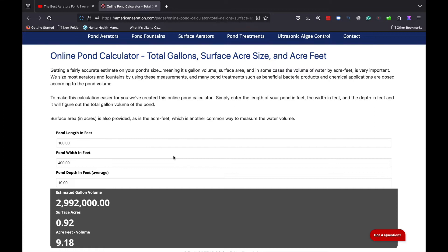Now if we're trying to cover a pond of this size, we will not likely do it with a single diffuser. No matter where we put it along the length, we're not going to be able to affect the entire body of water. The width is no problem because it's narrow — less than 200 feet wide — but with 400 feet in length we're almost double what a one acre pond dimension would be. In effect, by length I'm looking at this as a two-acre size range. Assuming I can maintain 12 feet of depth throughout most of this pond, two diffusers each covering an acre will work great in a 100 by 400 foot pond.